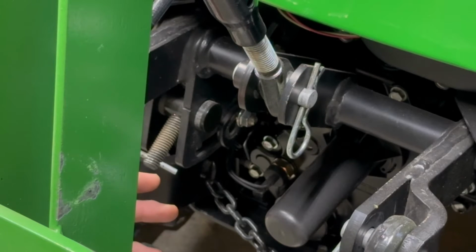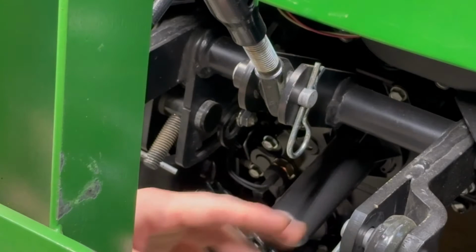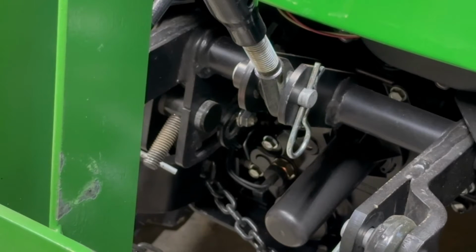Each of those is controlled by one of the two levers, and essentially this cylinder is also plumbed into one of the circuits up front. So even though you have something going on back here, something mid-mount, and then those two outlets, it's still only an H2, a two-function machine. I even have a set of auxiliary ports at the back here. That's not an extra SCV, it's just an extension of outlets essentially. So that circuit is going to be run off the lower lever. So you really only have two functions.